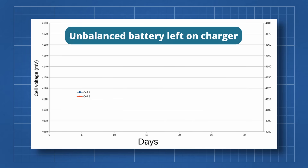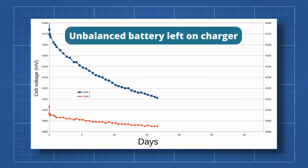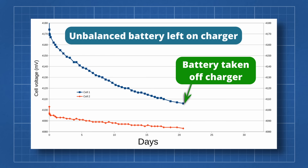I still wasn't satisfied, so I resorted to brute force testing. I drained the battery, let it charge, then left it on there and monitored the cell voltages. I'm eavesdropping on the I2C line, so my cell voltage measurements are identical to what the BMS is reading. Unfortunately it takes a very long time for lithium-ion cells to fully settle. I ended up stopping my test at 21 days as I was going away for Christmas, but it still hadn't fully settled. It kinda looks like it's draining cell 1 as the voltages are getting closer, but it's at such a slow rate as to be next to useless. After I got back from Christmas, the voltage difference had only decreased by 1mV.